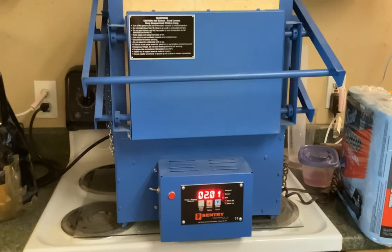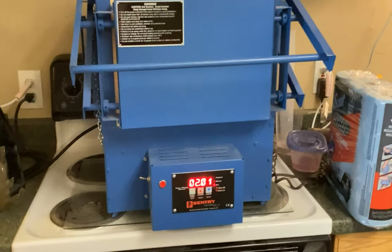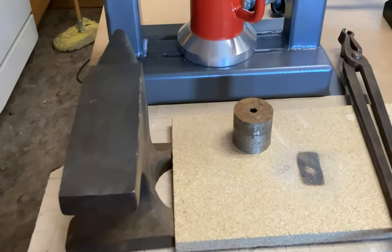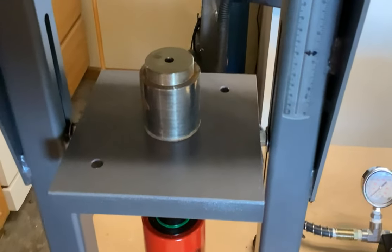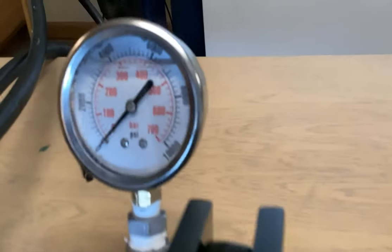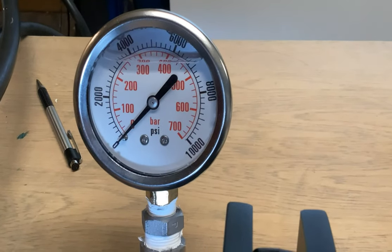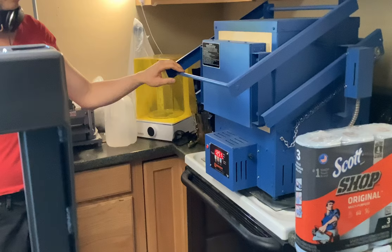The plan is to transfer from this kiln over to this workstation, remove the activated charcoal from the wrap, bring it back over to the anvil, place the top die onto the torque plate, and then onto the bottom die of the torque plate, pumping with the hydraulic press, and then bringing it to 8,000 PSI. Let's make some magic happen.